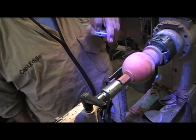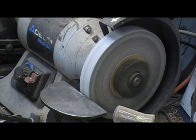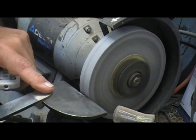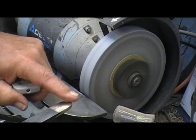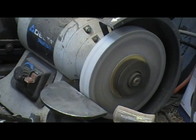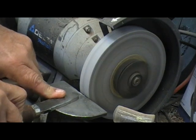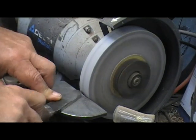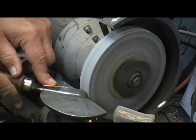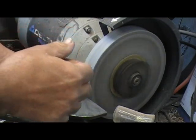Get you in another position. Let me show you a little something. When I sharpen my scraper, I need to have a wire up on top. The best way to pull the wire is to push it. It's like pulling a chain or pushing a chain. So mine is face down on the table, and I go around to put that wire on there. Very aggressive.